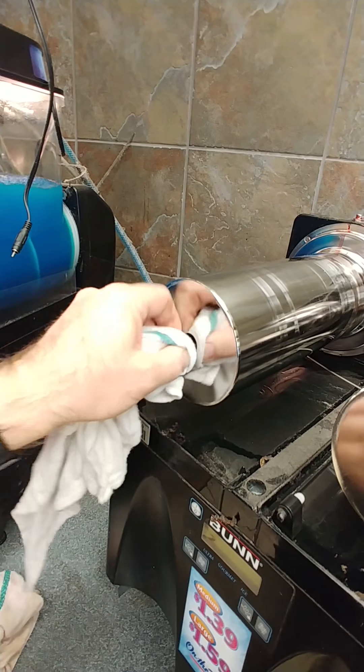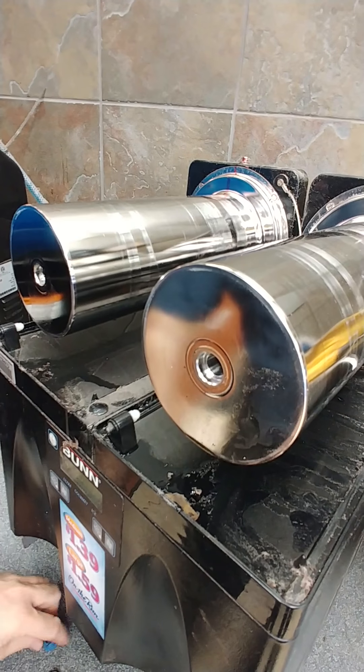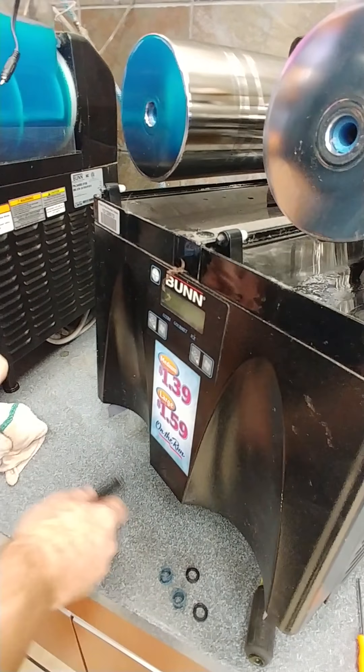To install a replacement seal, we do not use any lubricant on the seal. Take the new bushings and slide into the front of the auger barrel. The kit comes with a seal installation tool — put the lip side of the seal to the inside of the barrel, so the closed side of the seal goes on first on your tool and the open side goes into the machine first. Push that in until it's flush. Do the same on the other auger barrel — that is it for the installation of the seals on the front of the barrel.